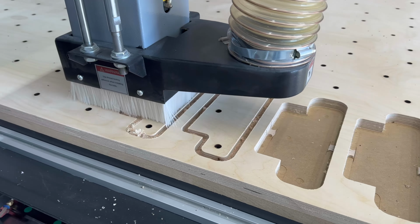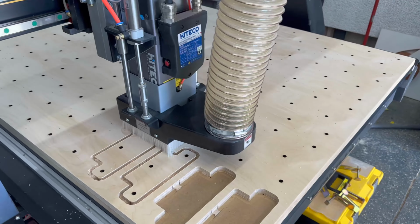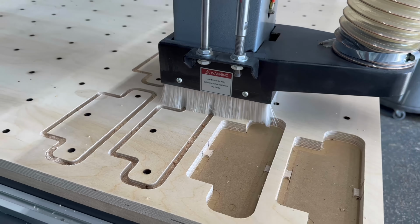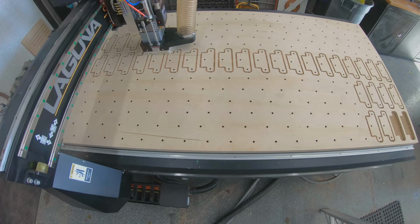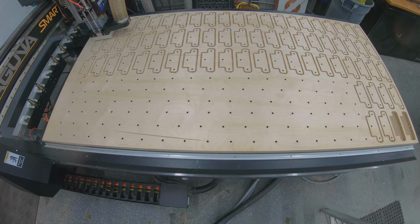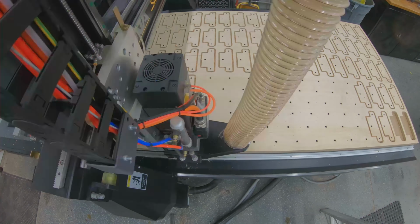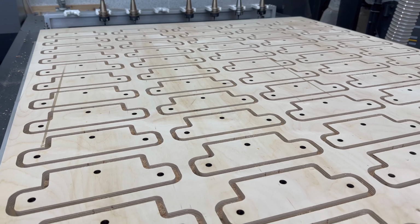Okay, so the first thing you'll see take shape here is this beam that gets bolted to the wall and holds those brackets for the bench. And so that beam is literally made out of all these layers of plywood. I had to just cut out that profile and then we stacked them. There's 3/8 holes in all of them, and the reason for that, as you'll see, I ran dowels through them to keep everything lined up and give it some strength too.